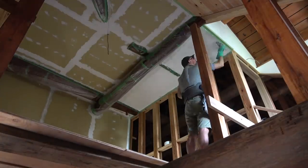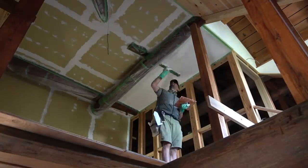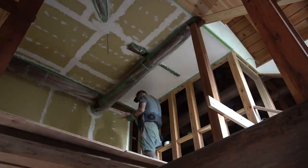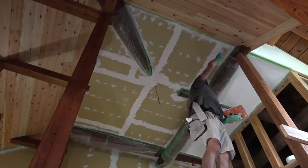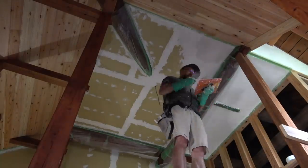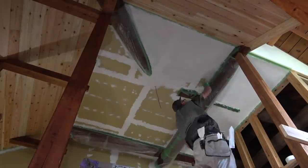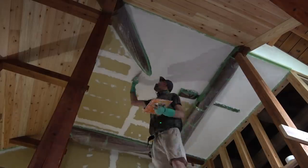You're supposed to apply two thin coats of shikui. You apply the second coat around one and a half to two hours after the first coat, after it's dried slightly, but before it hardens too much. This actually makes it pretty tricky to do big spaces, which we have a lot of, as you need to move quickly to do a full side in one go, which is recommended. Also, I'd recommend not doing the DIY shikui in summer, like I did, as it dries even more quickly.